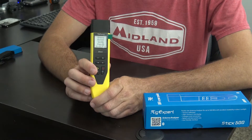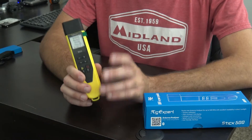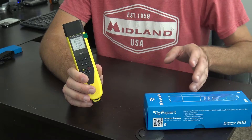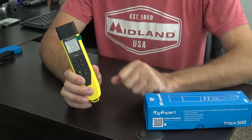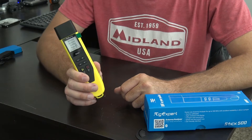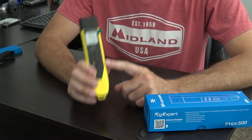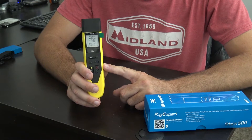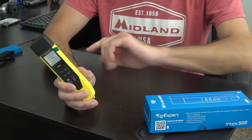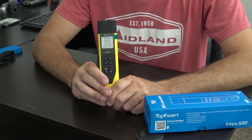The key thing about this is that having an antenna analyzer is way beyond having an antenna tuner, because an antenna tuner is not tuning your antenna. When it's behind the radio, it's tricking your radio to be happy with that 19 to 1 SWR that doesn't belong on your radio for 20 meters. But you decided to load up a stop sign and you think that it's good — no. The reason antenna analyzers exist is because you need to know what your antenna is doing. I don't use antenna tuners. Go ahead and find one in my house — you won't, because I just like to have resonant antennas.